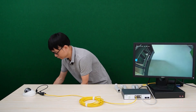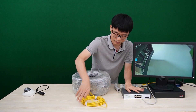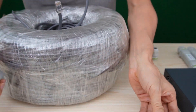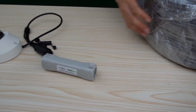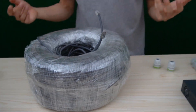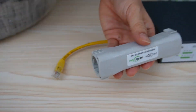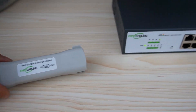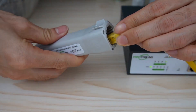Let me bring up the cable. This is the 1000-foot Ethernet cable, and I will replace the short cable with the long cable. I've placed two PoE extenders: one will stay just next to the PoE switch, and the other will be placed at the camera end. I need to connect all these devices together. Let's use a short patch cord to link the first PoE extender to the regular PoE switch. The tricky thing is you need to use the output port to connect to the PoE switch — just pick one of the PoE ports and connect the short patch cord to the output of the first PoE extender.